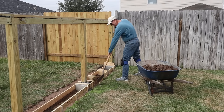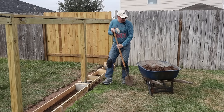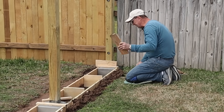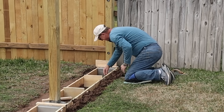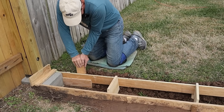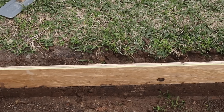I'm just taking and dumping the dirt in here. When I fill this, I'm not filling it clear to ground level — I'm only filling it to the bottom of my form. I've got boards in here at ten inches to hold the distance, just to be safe, even though the stakes are in there. I'm using a piece of plywood stuck down inside to hold it, and then a block of wood to compress it down in there — if I didn't, it would bow out. I work my way down, then take a hammer to push it back, and go through all the way down.